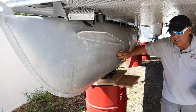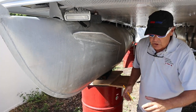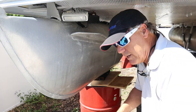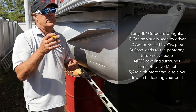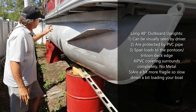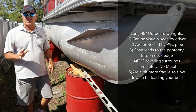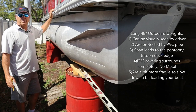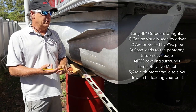We have to treat these hulls like tin cans — not as fragile, but in a way that won't damage them. These shorter uprights we don't recommend. We recommend the outboard uprights that go against the hull rail. The long outboard uprights hit the rail, not the hull directly, so you won't get tin-canning or pressing against the hull. The worst you'd get is PVC touching the hull, which won't cause damage.